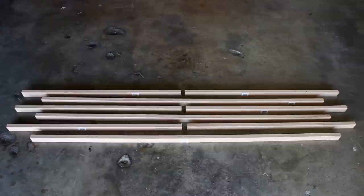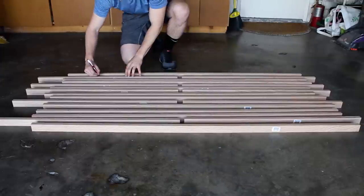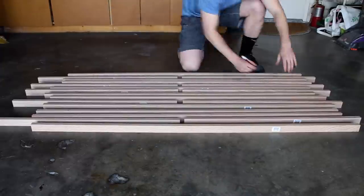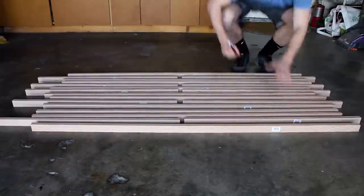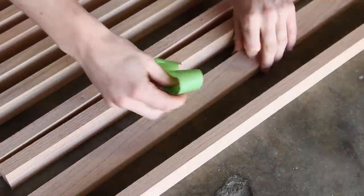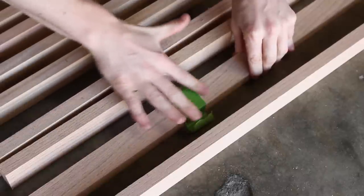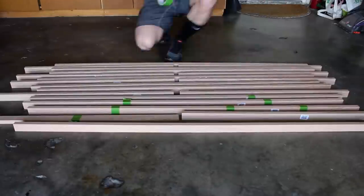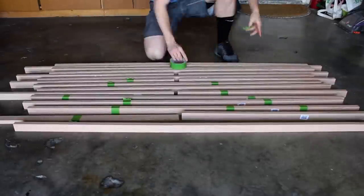I could then go back and insert the additional slats in between my longer pieces to add additional width to my desk. I wanted this project to have a really cool butcher block style look, so my next step was to mark out additional areas where I wanted to chop my wood down further to give the impression that the desk was built from many little slat pieces. I used tape to mark up each piece so that when I went to chop them on my miter saw, there would be very little tear out and my pieces could line up straight in the final assembly.